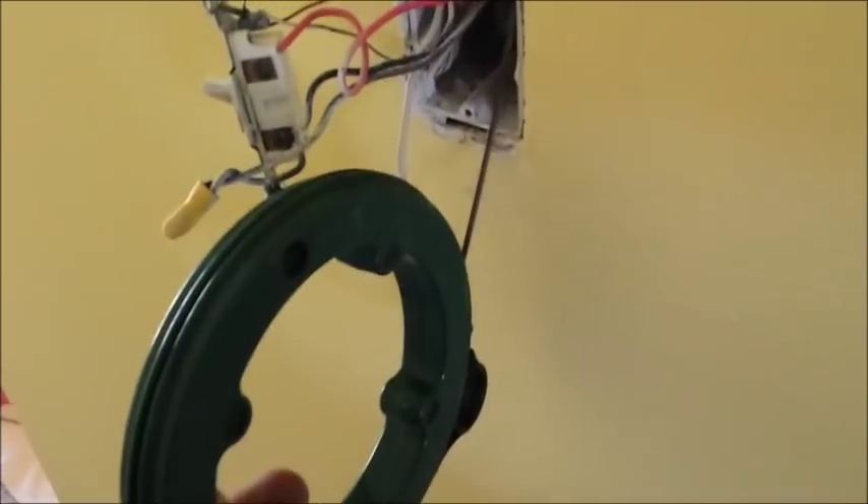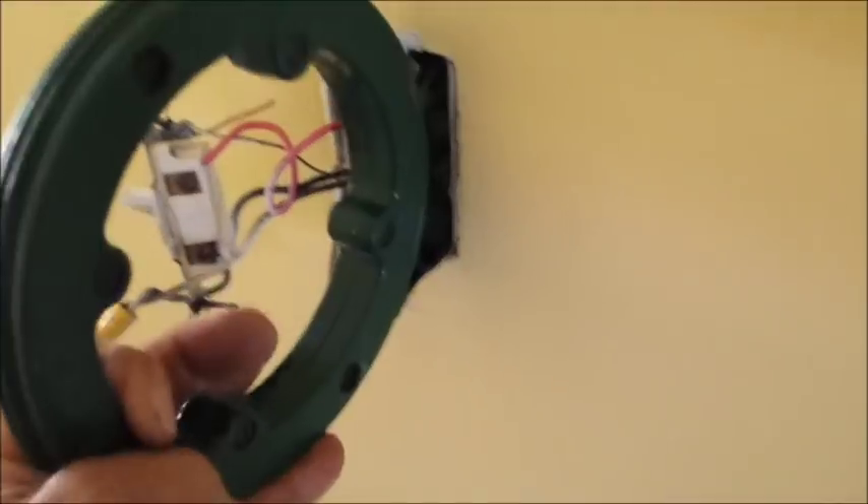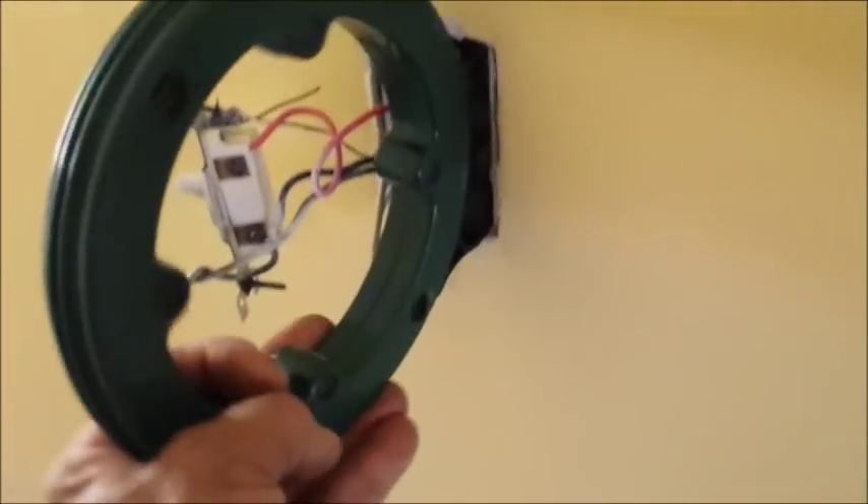Now ideally, we would go up here and cut a hole in the drywall and just push the wire right through that hole in the plate that we drilled from the attic. We're going to try to do it without that though. We've got our fish tape out here, and I've calculated the amount of distance that I need. Right there, if you can hear that, it's hitting the top plate. So what I'm going to do off camera is wiggle this around a little bit — turning it this way, turning it that way — try to get it to where I can find that hole up in the attic. I may have just found it. We'll go up and see.